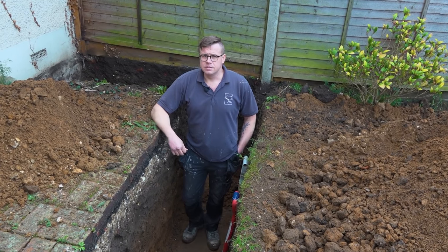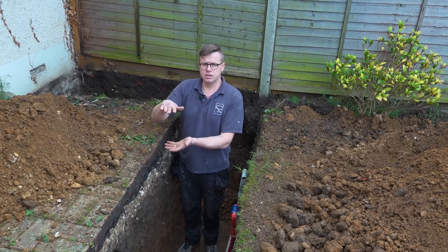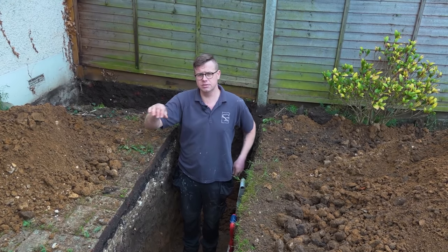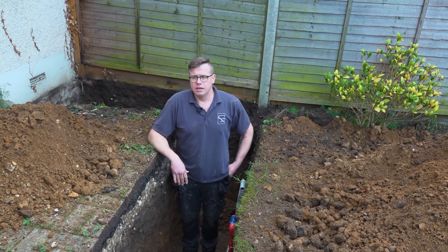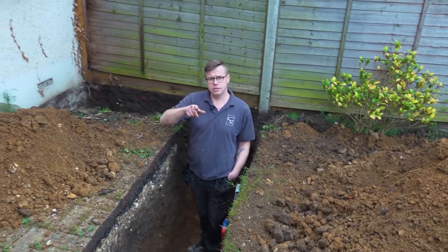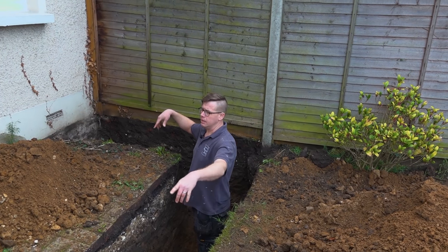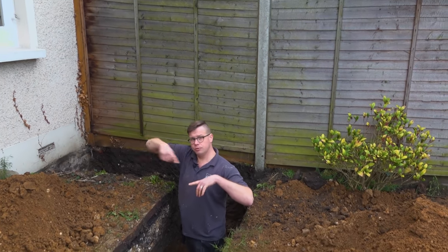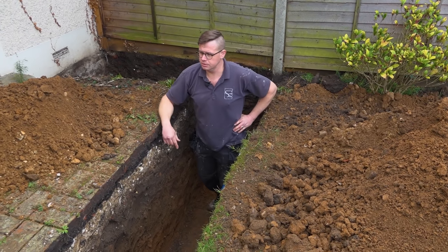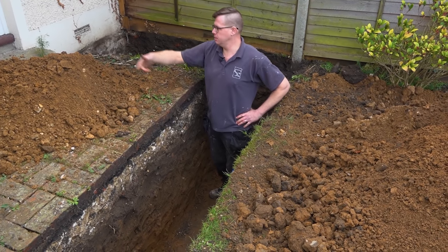It's 150mm of Celotex between the joists — we'll just screw a couple of batons on the side and push it down. I think they might be eight-inch joists because we're spanning side to side with no sleeper wall, continuing the floorboards through in the same direction. There's not much difference in cost between six and eight-inch timbers and there are only going to be about four.